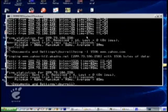The minimum, maximum, and average are all above 80 milliseconds. This is highly useful when you're troubleshooting network connectivity issues. This will reveal network congestion sometimes where a regular ping won't. Bigger packets are often blocked or slowed due to fragmentation or QoS or numerous other causes.